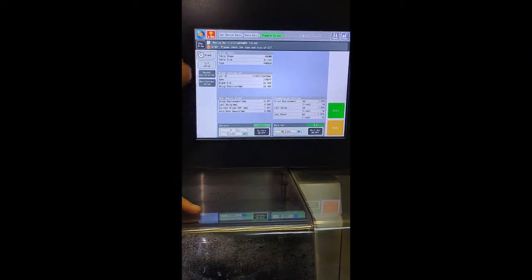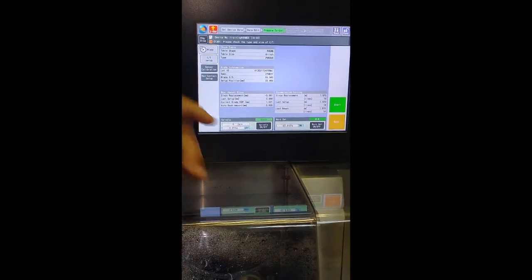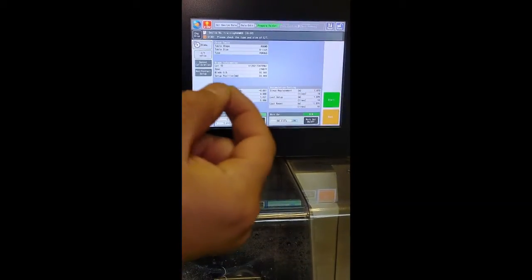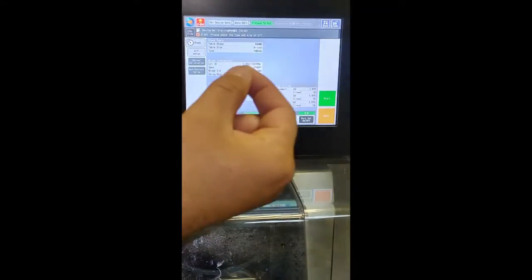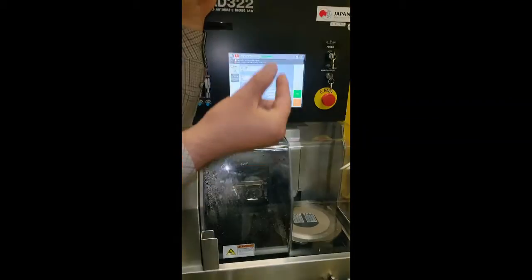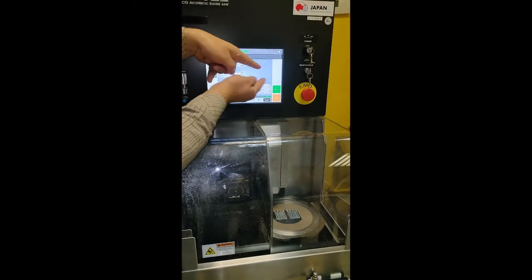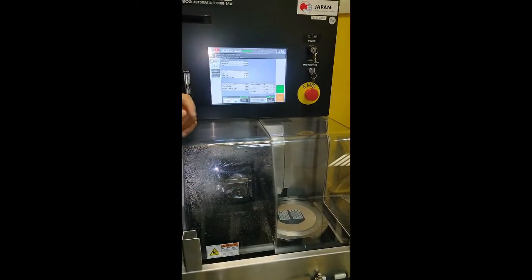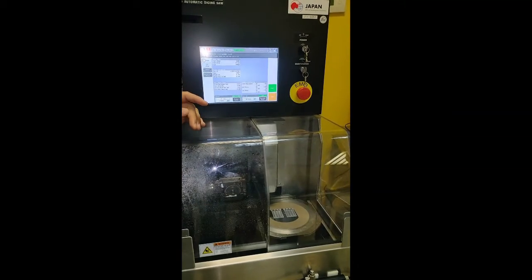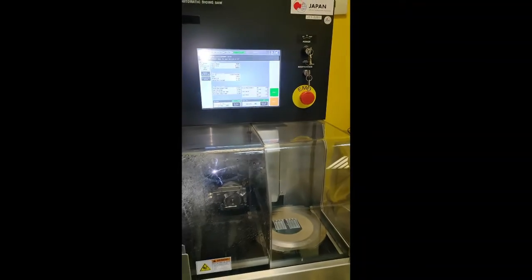After finishing these steps, we must adjust the hairline cutting of the new blade. The new blade has a thickness, and when it cuts on the workpiece, there is a width of the cut. We can adjust the hairline start and end for the dash line in the microscope to match the width of the cut that is done by the new blade. This adjustment must be done with the new blade.